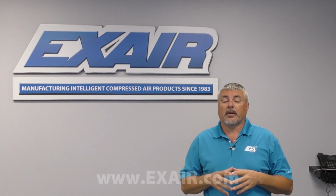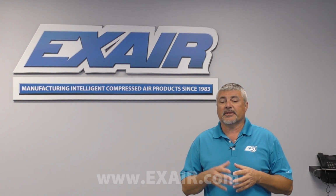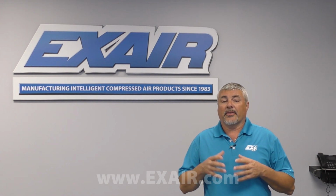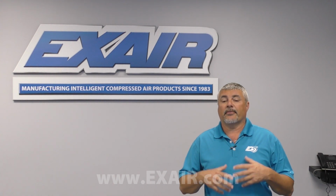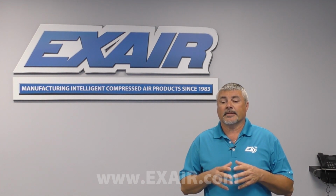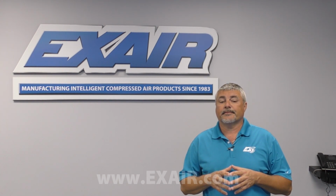In this video, I'll be covering the Chip Trapper system and the high lift Chip Trapper system. The only difference between these two systems is the vacuum pump and the length of the 1.5 inch vacuum hose. The pneumatic vacuum pumps are the same size, but the high lift vacuum pump can generate much higher vacuum pressures. Also, the high lift will come with a 20-foot hose instead of a 10-foot hose. But when ordering, they will come in the same size boxes.